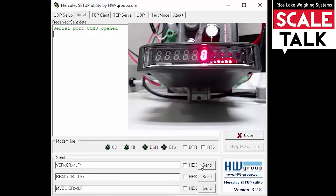The microvolts command will give us back the microvolts relative to the weight on the display at the time. Let's go ahead and click the Send button to send the version command to the unit. We expect to see a response if everything is communicating — and it does. It responds with version 804.